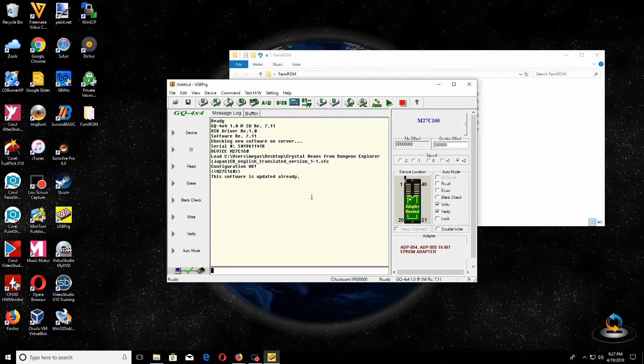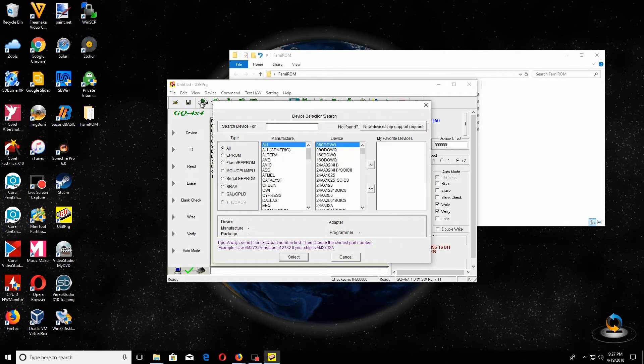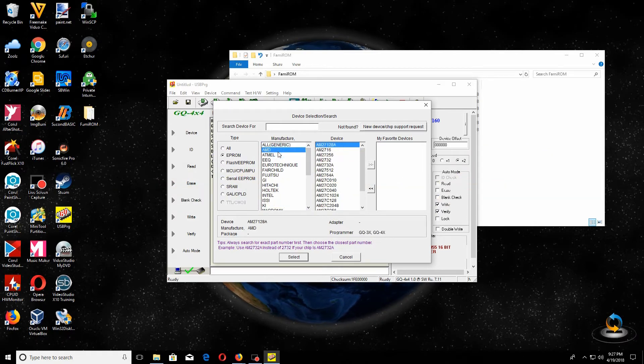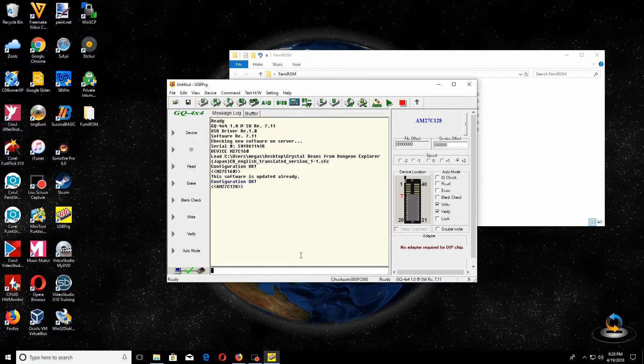Don't worry, that's a different type of ROM I was making before — I was trying to do a Super Nintendo game, which worked perfectly, but that's for another time. We're going to choose the device, which is basically the chip you're going to be using to burn — the 27C128. We choose D for device, then choose EPROM. You'll notice a list of manufacturers. In this case, it's an AMD chip, so we go all the way up and choose AMD. The chip says AM27C128, so you go down the list and find AM27C128 and select that one. It's checking to make sure it has the correct information to burn on the chip.